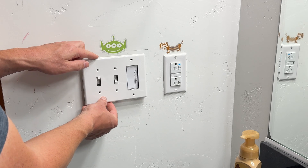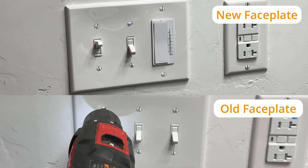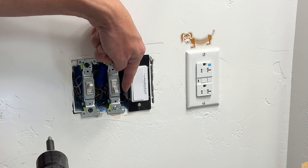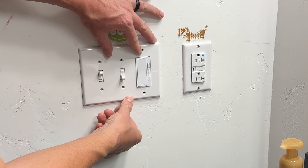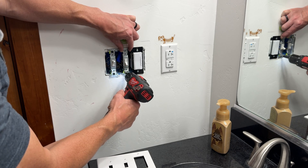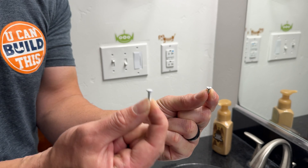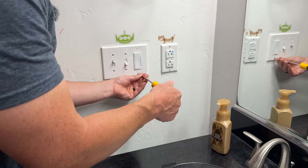Now with all the switches back in, we're going to put our faceplate on and make sure we're aligned — we need to shimmy things over a little bit before we finalize their locations. Just be careful so you don't pinch anything, and if you touch the screws on the side you'll get shocked. With everything aligned properly we can cinch these down. It came with two short screws and four long ones — the short ones go on this switch and the long ones go around the faceplate. Don't make them super tight or you'll break the faceplate. We hope this gave you the confidence to do other small projects like this. Thanks for watching and we'll see you on the next one.